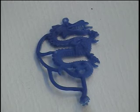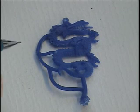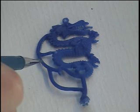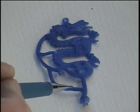Before we continue, I want to talk about spruing and the positioning of sprues. Rings are pretty simple for the most part, but as you can see, this dragon here is a pretty complicated design. What you need to remember is that the molten metal, when in the casting machine, will go in one direction only. It cannot turn corners and come back. So in this one here, they factored it in by having branches which allow the metal to flow evenly to all aspects or all places of the mold.